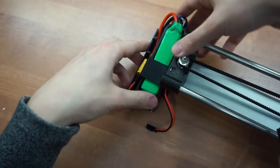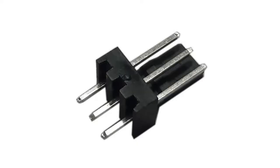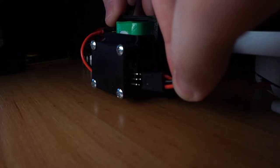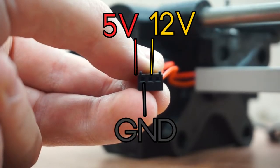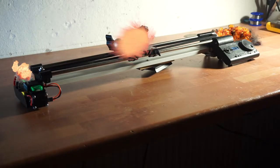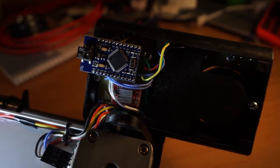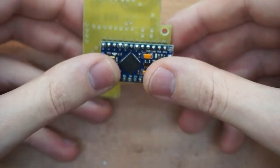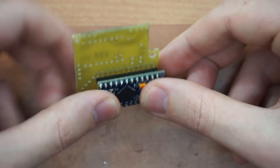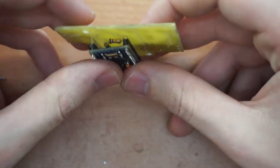One detail that I overlooked, however, was using the incorrect connector. I should have used this one and not this one, and of course I managed to shift the connector by just one pin, but that put 12 volts on the 5 volt rail and I had to replace pretty much everything. Of course, I didn't have the same Arduino, so I ended up with this monstrosity. For now it's okay — I'm waiting for the Arduino, and once it arrives, I won't install it because why would I do that? It works and that's good enough for me.